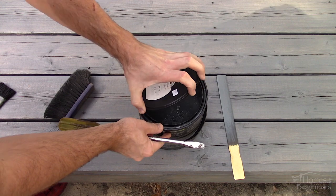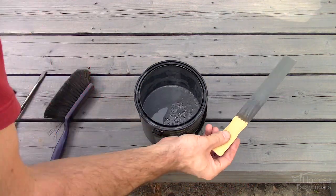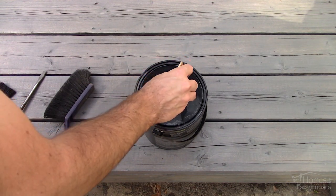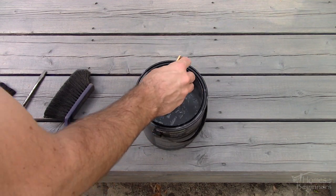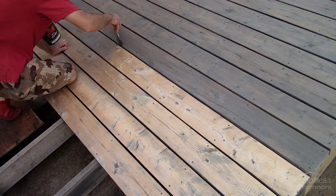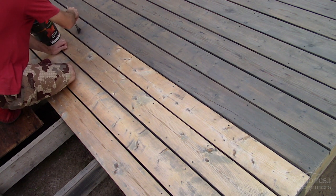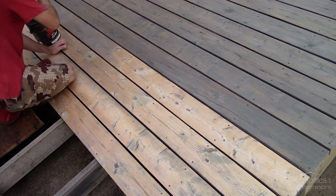This is a water-based stain as per Canadian regulations made by a company which specializes in log homes. This stain was unfortunately double the price compared to the original stain that was used. However, from our experience, it holds up extremely well. Ensure the stain is mixed and then apply it to the surface using a brush. A brush is needed to work the stain into the surface, and this particular stain is a two-part application.